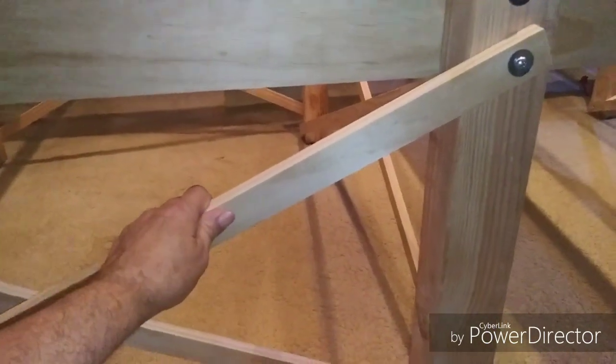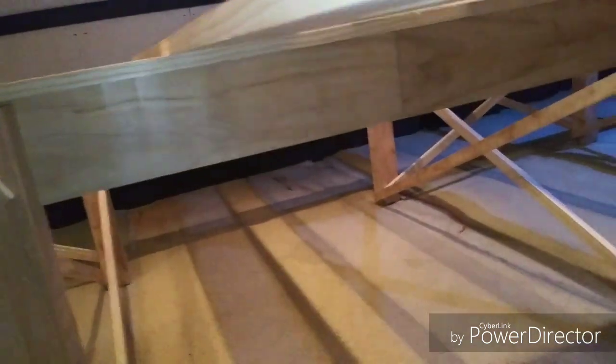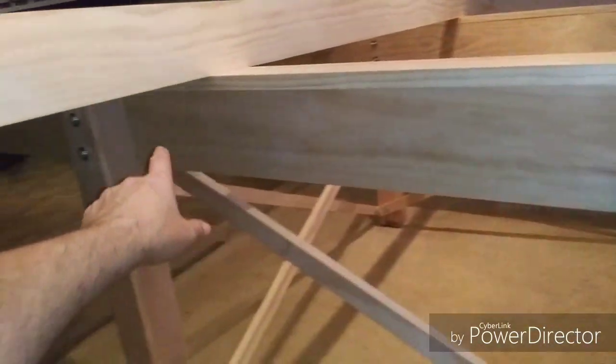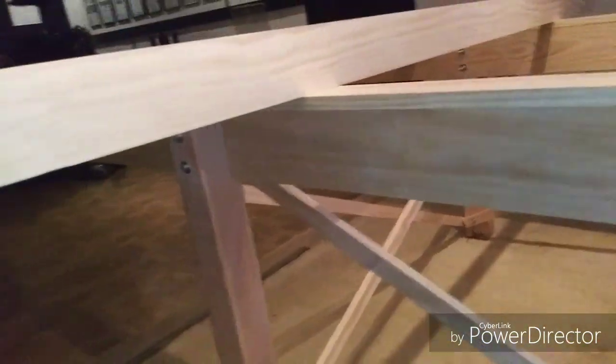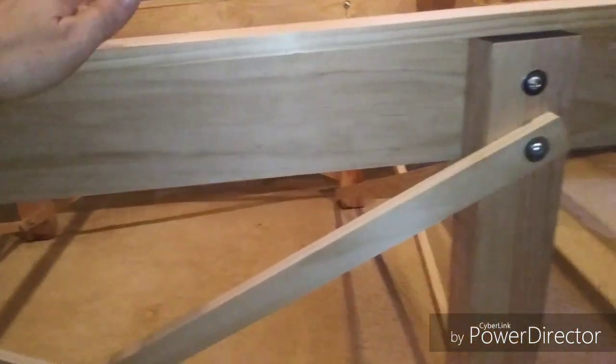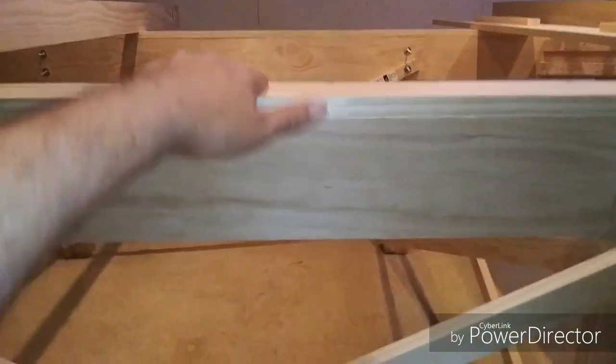These braces are cut about 58 inches long, just to give you an idea of the dimensions. From the joint to the center of the leg is two feet, with a four-foot span to the next leg, and a two-foot cantilever. I just did all this to make the math easy. So that takes care of one of the frames I constructed.